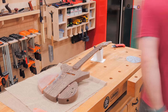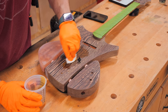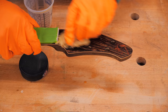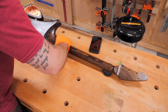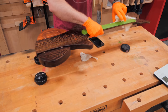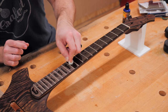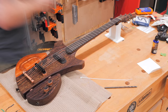After disassembling the guitar, I gave everything another good sanding, making sure to hit any spots that got dinged during the assembly process, and then it was time for finish. I knew I wanted a matte finish on this build, as I personally much prefer a matte finish to a super glossy finish, especially on a guitar neck, and I also needed a finish that would play nicely with the epoxy portions of the guitar. After considering a few options, I decided to go with Rubio Monocoat, which I've had a lot of luck with in the past on epoxy and wood projects. Rubio is super simple to apply - I just mixed the oil with the accelerator, wiped it on, and let it react with the wood for a few minutes before wiping off the excess, and I was left with a beautiful matte look that felt great in the hand. Once the finish had a chance to dry, I oiled up the fretboard and then could get the guitar reassembled, also using a little string winder adapter that I 3D printed, which really helped speed up restringing.